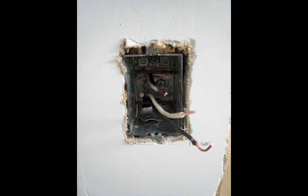And there's my wires. And in order to connect them to the terminals, or the screws on the side of the light switch, you're just going to take your pliers and make a little kink or bend in the black wires. Now the white wires, the neutral wires, they actually get connected together. So all you have to do there is place them side by side, take pliers and wrap them around each other, and then you're going to put a marrette, a little plastic cap with metal inside that allows you to kind of screw them together.